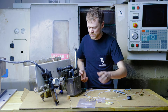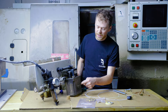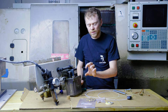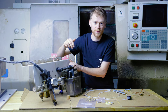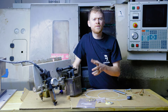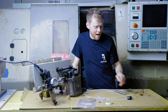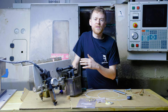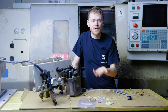When troubleshooting this system, the first thing you wanna look for is: does it build pressure? There's a little gear inside here that runs at about a 20-minute cycle. Once it completes a cycle, there's a lobe on a cam. It pushes this plunger up, and then it drops the plunger — that's one cycle. It'll then build pressure, 40 or 50 psi, depending on whether you have a lathe or a mill and how many metering points there are. Then it'll flip the pressure switch, and over two to three minutes or so, it'll drain back to zero.